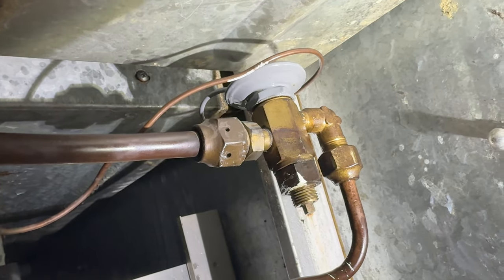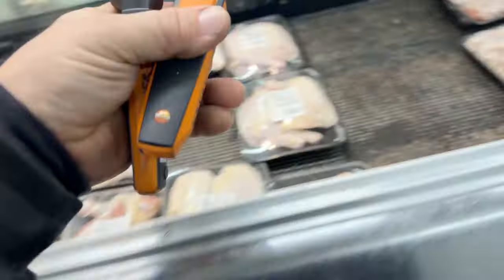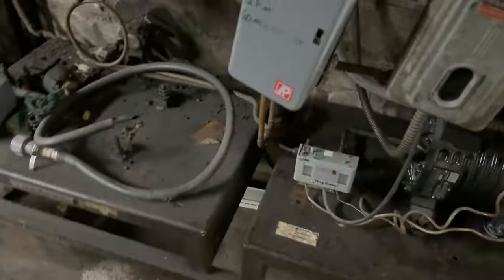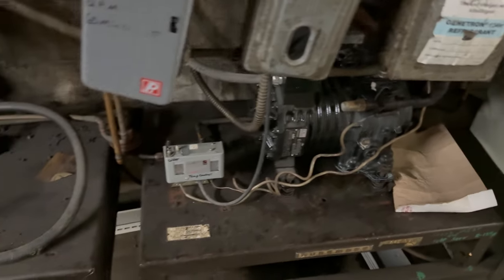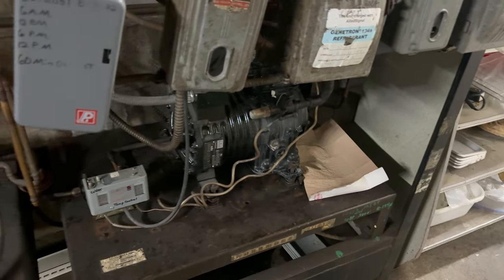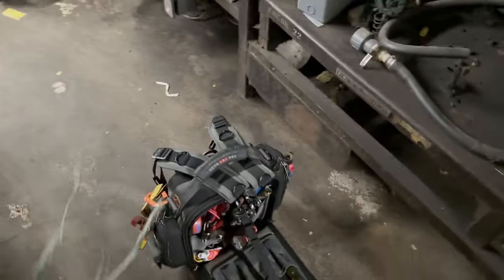That's about as much as I can do for the day. We've got that marked for a new valve. Got it back as close as we can get it. Checking temperature right now with my Testo Pro — we're right around 39 degrees. The other one a little lower. I took it just a touch lower and it seems like it's doing good now. I got the valve ordered. The head on it right now is actually a low-temp head — how it worked, I don't know. We're going to get the right valve: it's a balanced port, flare and flare. Everything's sealed up. We'll check it once it's running before I decide whether I'm charging for the refrigerant, because that may not have been needed — that was my fault for getting in a hurry.